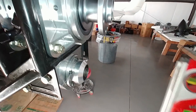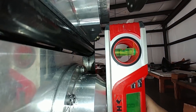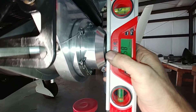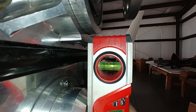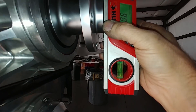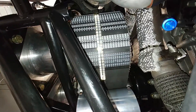Welcome back. When I last left off I was in the process of trying to get these pulleys aligned on the redrive. As you can see here, I got basically 90 degrees on the lower pulley and on the top one pretty much the same thing - so that's not far off 90 degrees in terms of level. However in testing that really doesn't mean much, because what ends up happening is when the redrive is turning, the belt wants to walk towards the front of the aircraft when turning in the normal anti-clockwise direction.